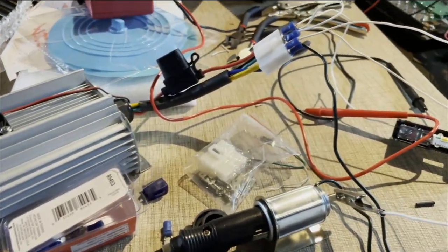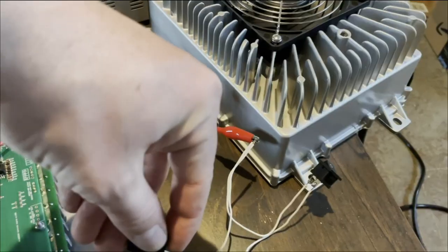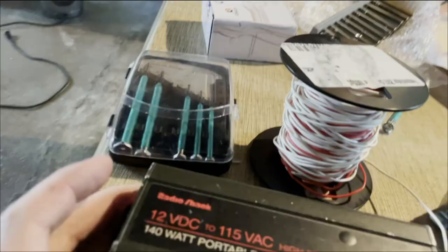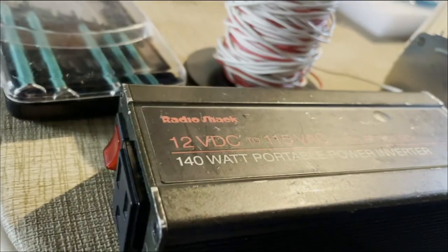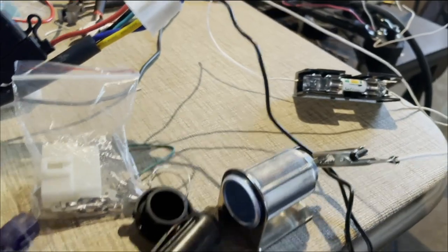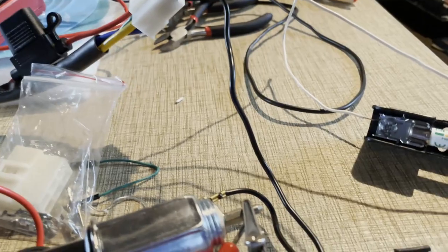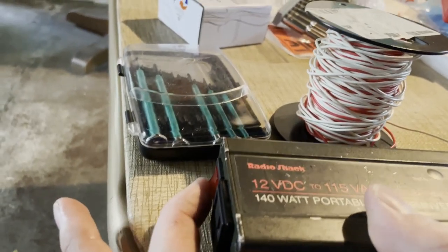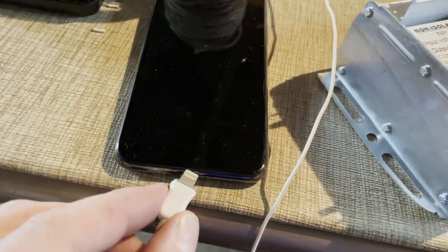This is theoretically wired up to work properly. Power supply on. Supply the 12 volts. Pre-charge on, main on, pre-charge off. Getting 12 volts to that, which means if I flip this switch... it doesn't turn on. It's possible that this is just maybe too demanding. Unless these two wires are backward. In order to reverse the polarity, I'm going to shut everything down. I reversed these and confirmed that it has positive voltage now. Plugged in the inverter and still not doing anything — not getting any power light. I've heard iPhones don't take nearly as much power. Let's see if it'll charge this iPhone X.